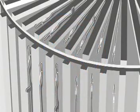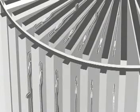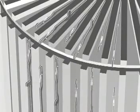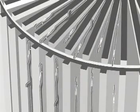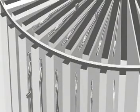When needle 1 in the cylinder is knitting, the corresponding needle 1 in the dial must rest. This is achieved by the alternating needles in the dial and the cylinder never being activated at the same time. This requires 2 cam tracks for both needle beds. Therefore, the location of the butts on the needle shank must be in 2 positions.